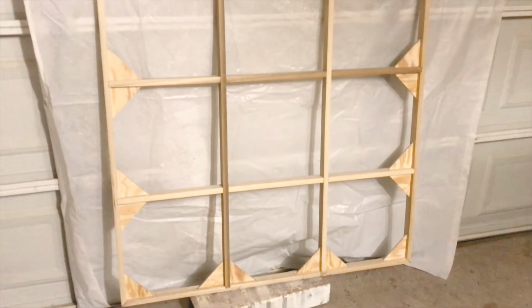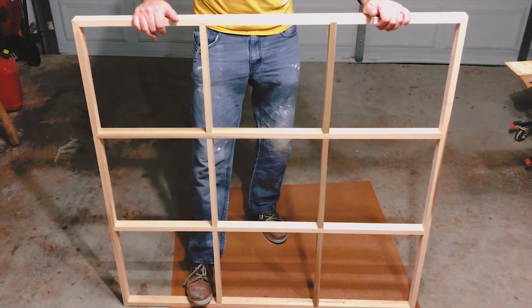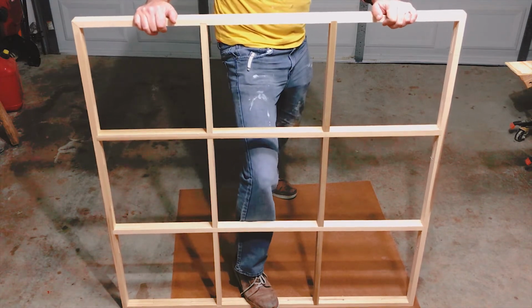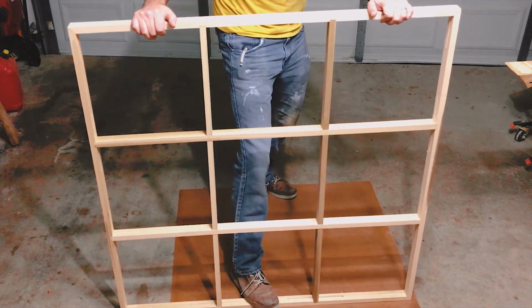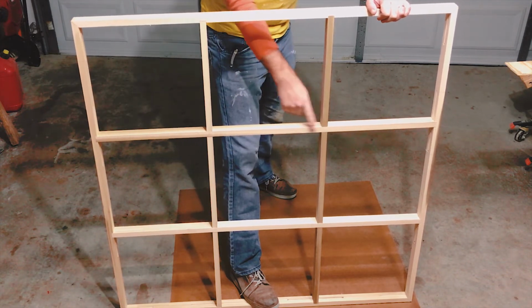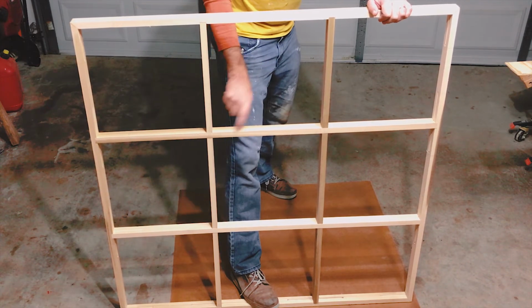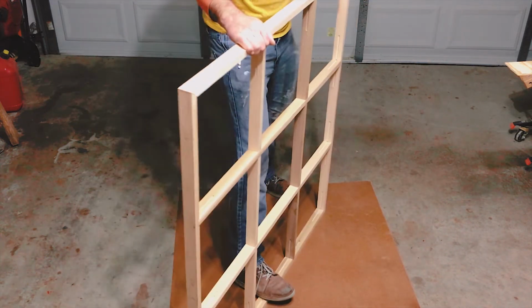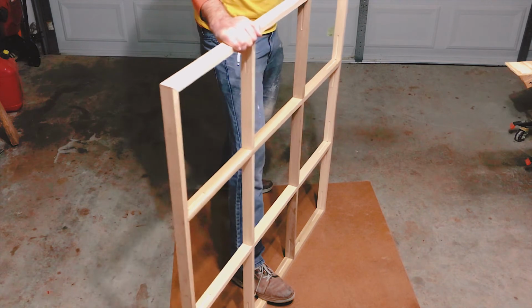The structural triangles may seem like a lot of work, and they are. But if you want to be a professional artist, this level of care and craftsmanship that goes into building your painting supports is exactly what it takes. All the joints are points of articulation. That means if moisture starts warping the wood, the distortion will either originate from, or traverse those joints. So we need to arrest motion in them as much as possible.